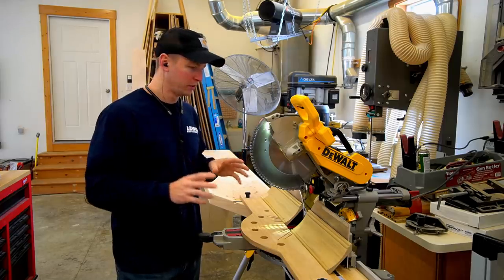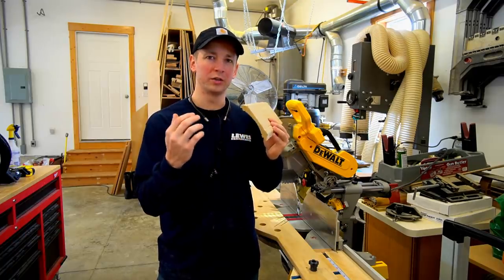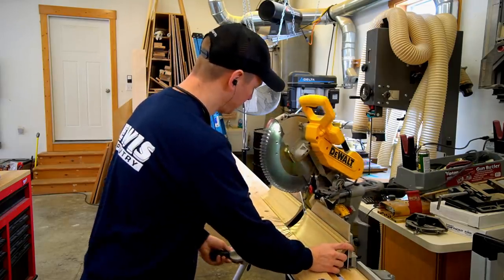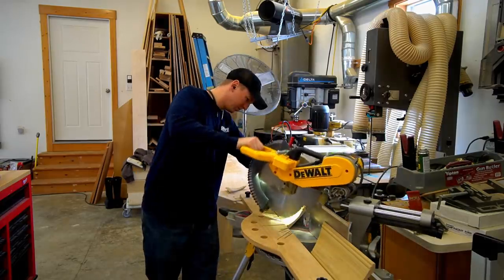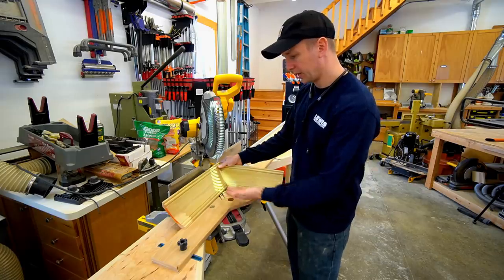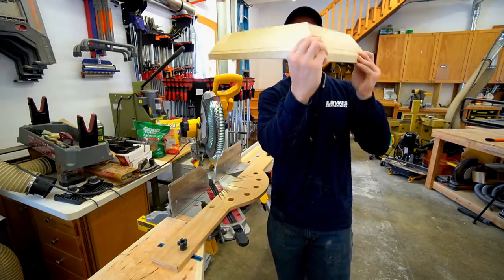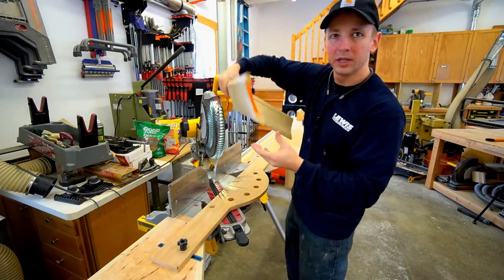As many of you know who have watched my videos, I prefer to cut crown molding in the nested position versus cutting it on the flat. Our miter saw base becomes the ceiling and our miter saw fence becomes the wall. So let me put a couple of 45 degree cuts on these. With two 45 degree cuts, these pieces of crown molding would go together like this. That's why they say we cut crown upside down and backwards.